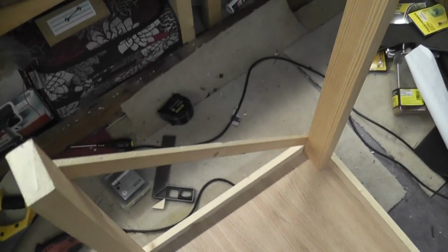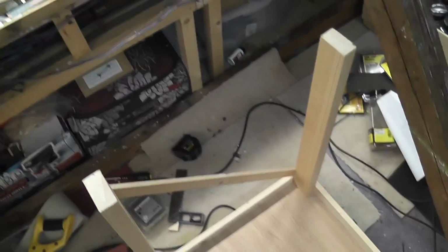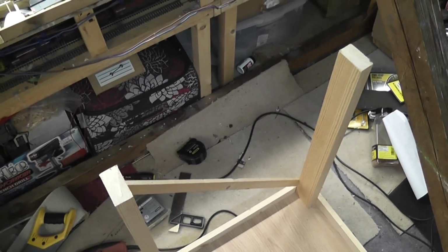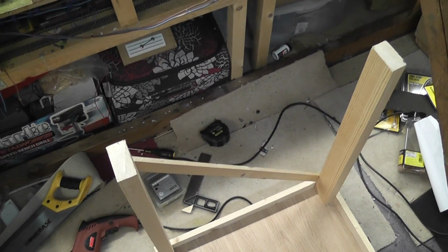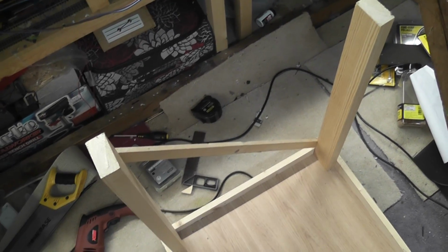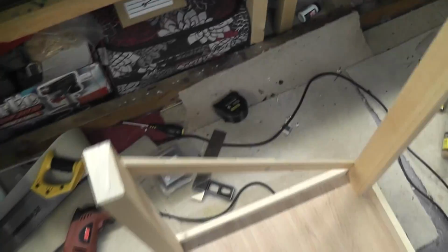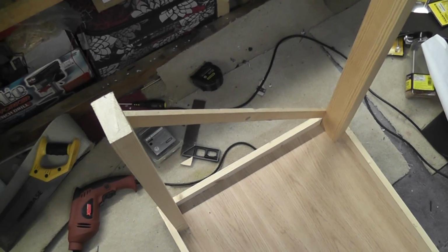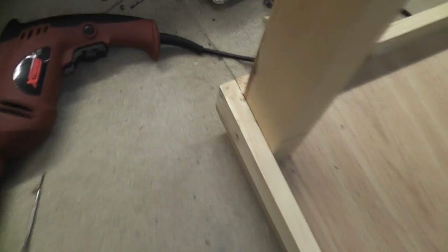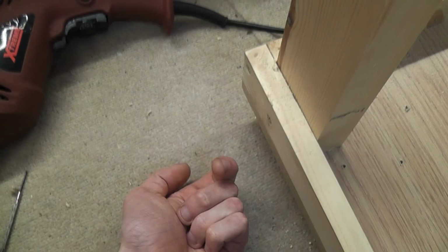Okay, so I've made some legs. They're different lengths because the floor up here isn't particularly even. Just two pieces of timber, and I'll put a little piece across to brace them a little better. They will be screwed to the beam that runs along there, so it'll be nice and secure once it's in. At the bottom I've got a screw this side, a screw this side, and a screw up from the tabletop itself, so they're not going anywhere.